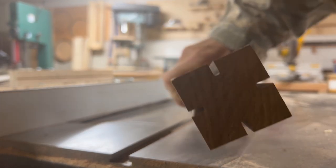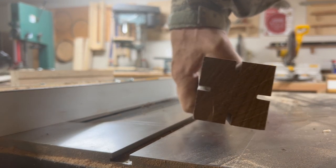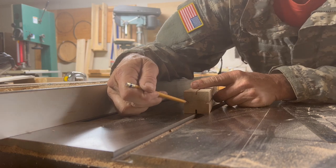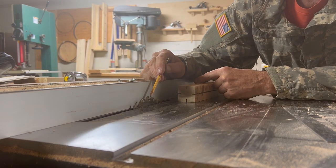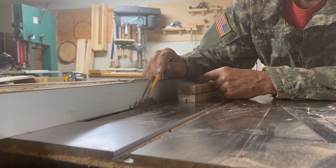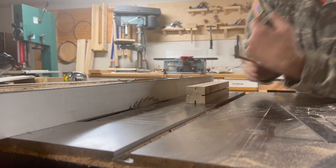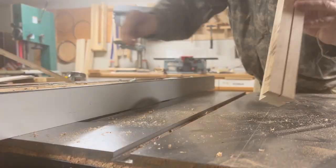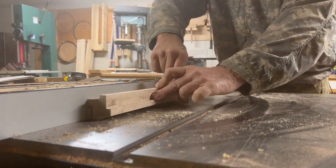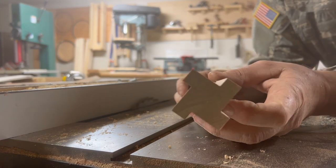Here's what it looks like when you get done cutting the groove in all four sides. For this next section we are going to be slicing off this portion here. Reset your fence so that the outside of the blade is one-quarter of an inch away from your fence, and that it's seven-eighths of an inch to the top, so we can peel off the excess that we want. After making your cuts, your block should look like this.